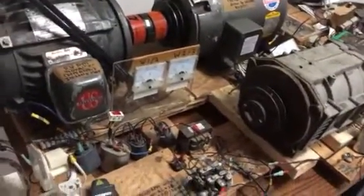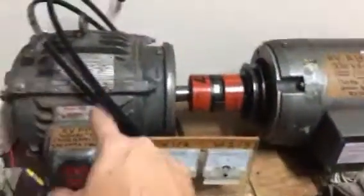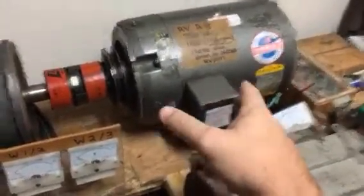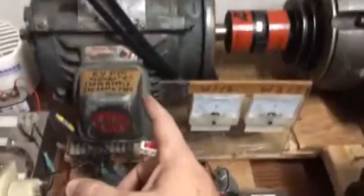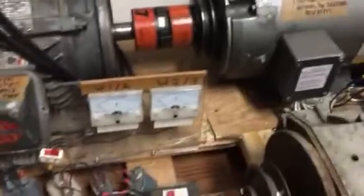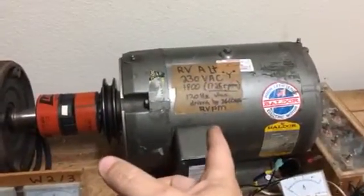Here's a video showing the progression. I'll go back to using two motors: a drive motor, a three-phase motor being spun twice as fast as its rated speed. It's an 1800 RPM motor, but this one is running at 3515 RPM, direct nose-to-nose coupling.